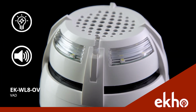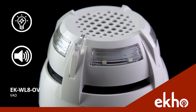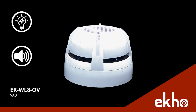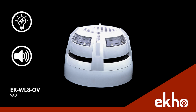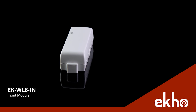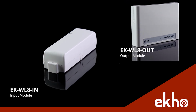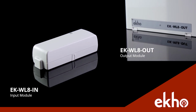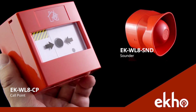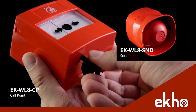For additional EN54 Part 23 requirements, there is also an approved optical sensor with integral VAD and voice alarm. The device features 3 pre-recorded voice messages, and these can be reprogrammed by the end user. For the control and monitoring of other devices, there's also an input module and an output module. And finally, the system offers an indoor use manual call point and a wall-mounted sounder with 4 inbuilt tones.